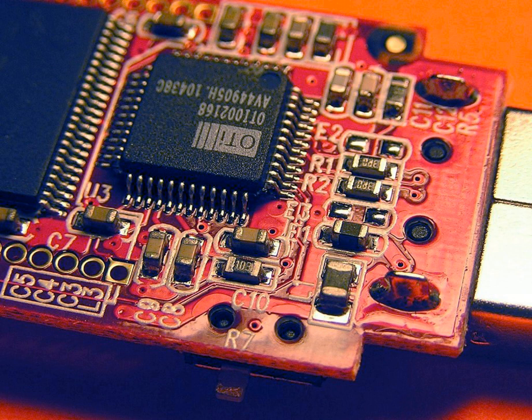Generally, physical size is proportional to capacitance and squared voltage for the same dielectric. For example, a 100 nanofarads 50 volts capacitor may come in the same package as a 10 nanofarads 150 volts device. SMD non-electrolytic capacitors, which are usually monolithic ceramic capacitors, exhibit the same body color on all four faces not covered by the end caps. SMD electrolytic capacitors, usually tantalum capacitors, and film capacitors are marked like resistors, with two significant figures and a multiplier in units of picofarads or pF, 10^-12 farad.